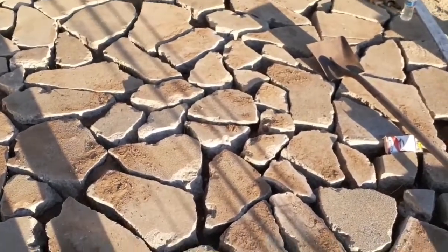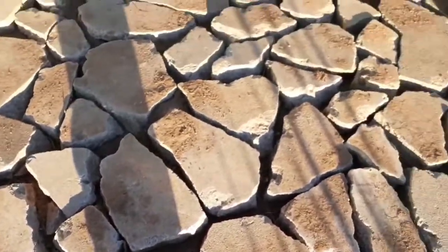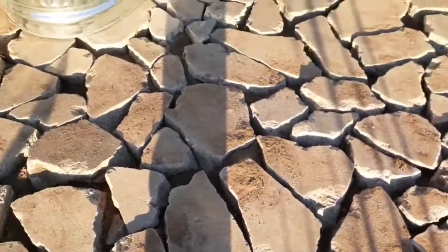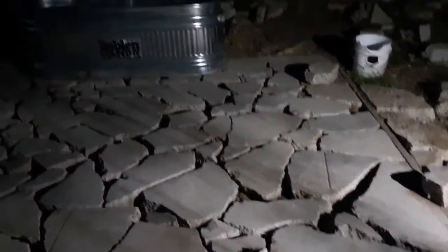Even the foundation was all recycled concrete slabs that we obtained during some work. I laid them all down by hand to get them all nice and snug like a puzzle piece, even spending nights to make sure they're all leveled and equal to each other. That's so we can fill up the cracks with sand or even concrete, depending.